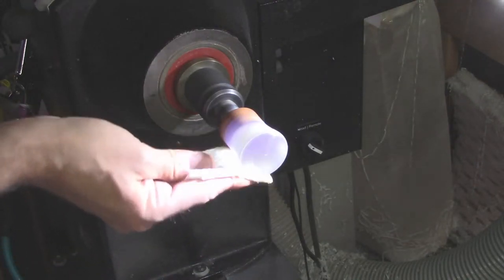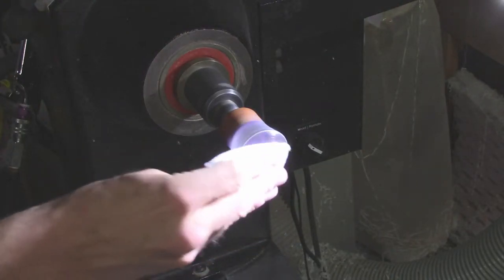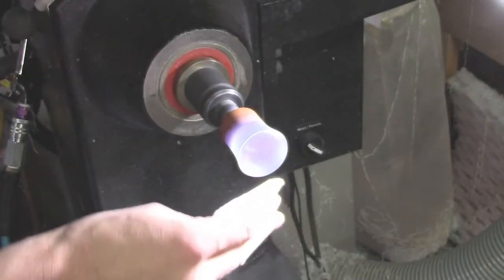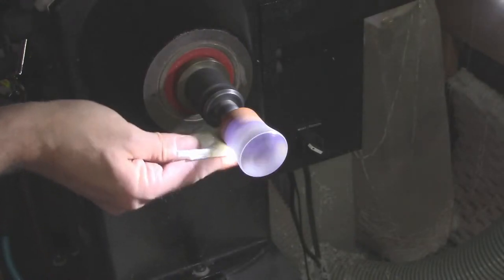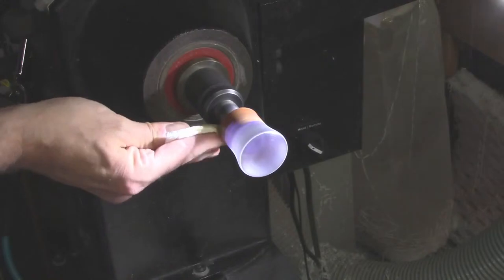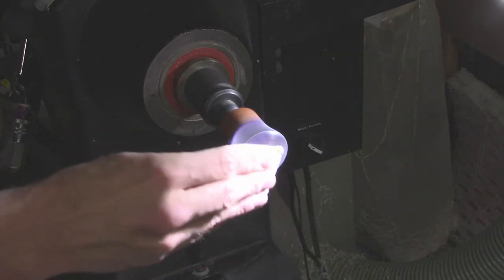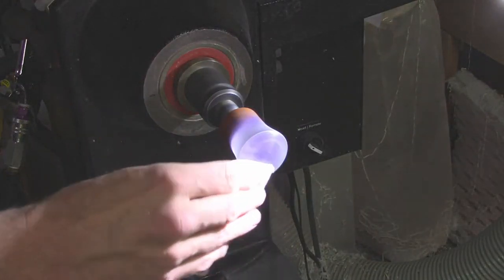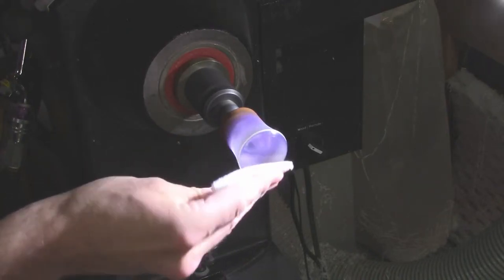Expand and contract. One thing, if you get things a little bit warm, here's something where maybe I can give you something that actually has some meaning. If you're drilling something out and you overheat the resin, that can destabilize stuff, like bonds between materials, which may be some sort of expansion contraction type thing causing it. Also, some materials, I've seen people turning them and they get really soft if they get warm. So that can happen too, I guess.